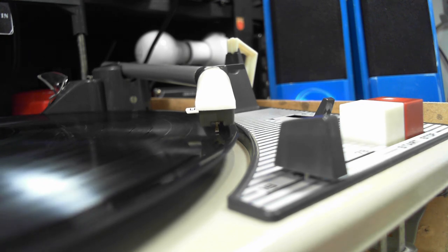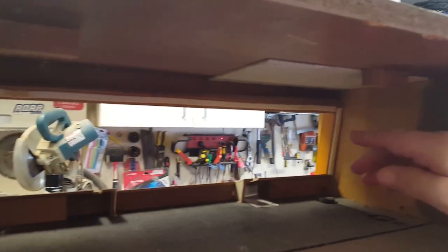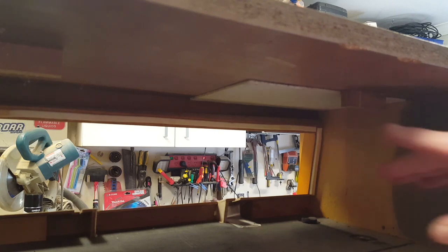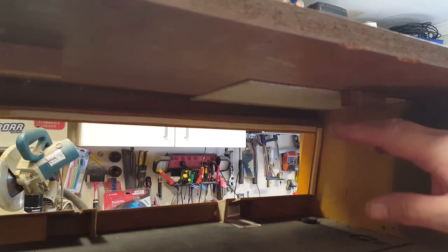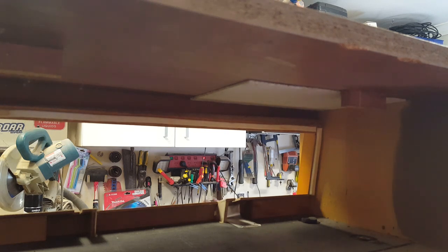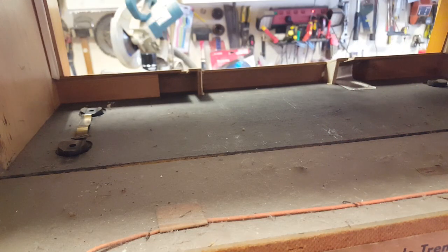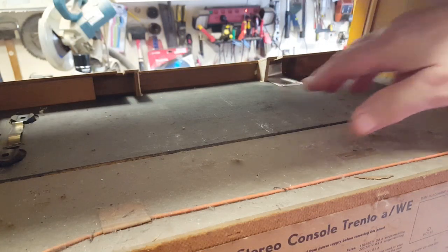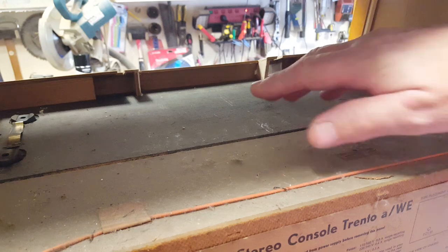I've got the cabinet out in the workshop. Something I noticed that needs to be attended to - in the compartment where the radio sits, they've put some asbestos on the top. I'm thinking whether to take it down, which will definitely make asbestos dust, or just paint it with some clear lacquer to hold the fibers together. That's there to protect the timber from heat discoloration. I'm going to spray the whole area with water, then wipe out the dust, put the rags in plastic bags and throw them out.